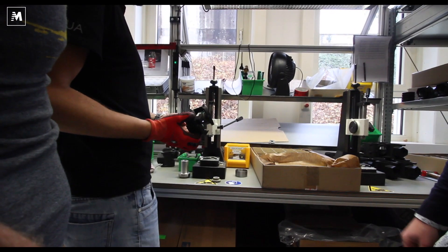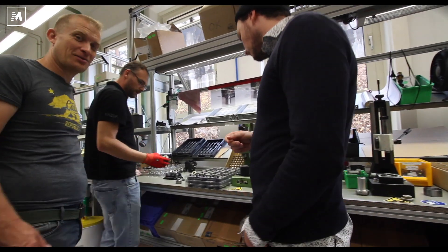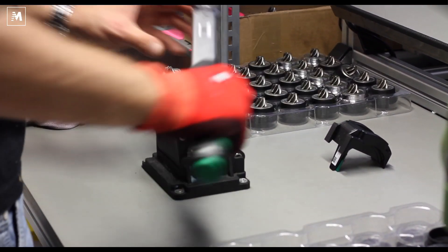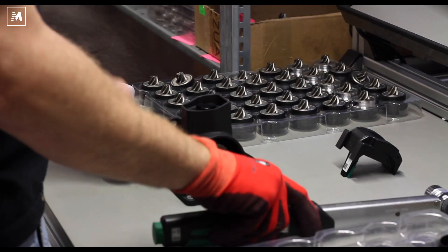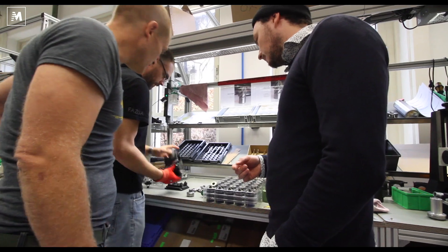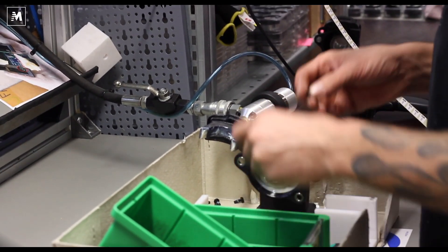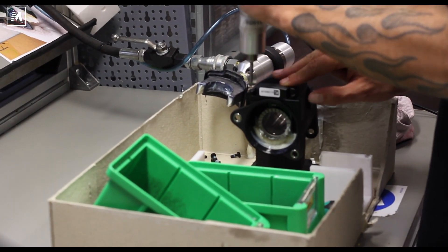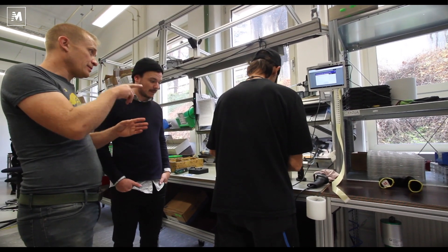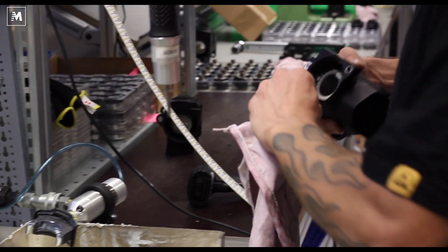So those are the two parts — complete at this stage. We've got more bearings and bits here. This is the angle gear that is transmitting the power of the motor to the bottom bracket — it translates the power and transports it. Alex just implemented a sticker with the serial number of the torque sensor, so we have a serial number aside the serial number of the whole bottom bracket. The system knows that torque sensor and that motor, so you can see in production if there's ever a problem with a batch.